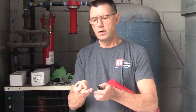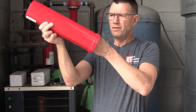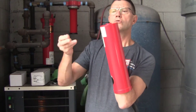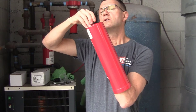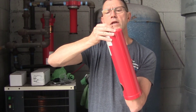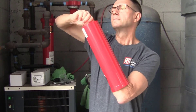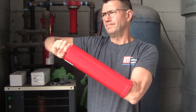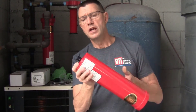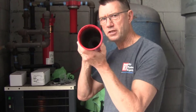Here's the new float drain valve. Washer goes on first over top of the nipple. Reach this all the way up into the side, turns through, put your nut on. Center it right in the very center, then tighten it on. Hand tighten is good enough — you don't need to put a wrench on it. What you're doing is drawing down on that rubber gasket to form a seal. That's all there is to it. Nice and clean on the inside now.